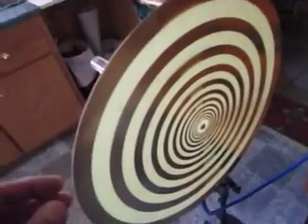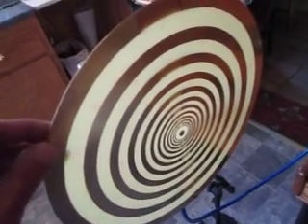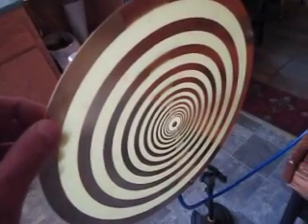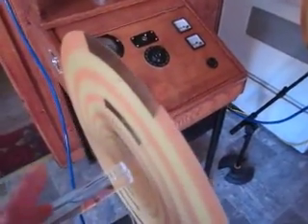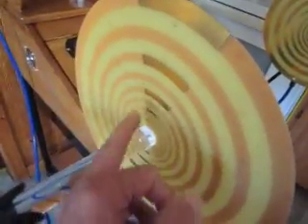Both antennas are plate antennas designed by Eric Dollard, and I made them exactly as he specified. They're FR4 material with two-ounce copper traces, gold-plated by an immersion process. I have two of them, and they have capacitive strips like the original ring antennas — the rings are finished with little metal balls which act as capacitors, and those strips on the back do the same thing.